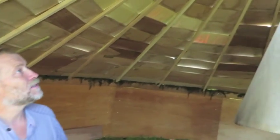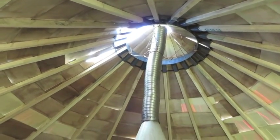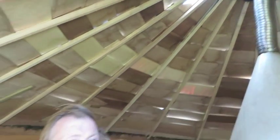When I originally built this, I used roofing batten because it's cheap, affordable and easy to get hold of. I joined the tops with wire to secure them and then tiled it with 4mm ply. But this year I wanted it to be much easier to put up. So I've used, same as a yurt, a cartwheel in the roof — this time a steel cartwheel — and ash poles that slot into the tubular structure at the top. That was really quick to put up.